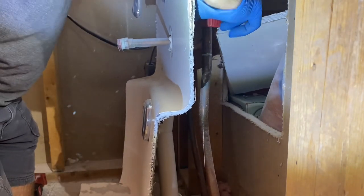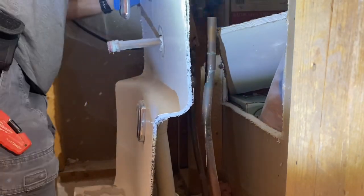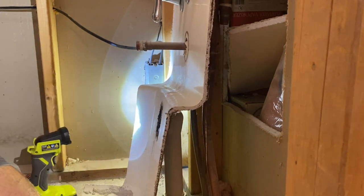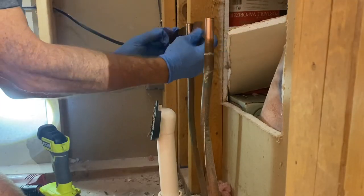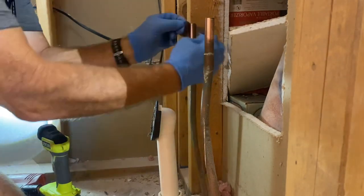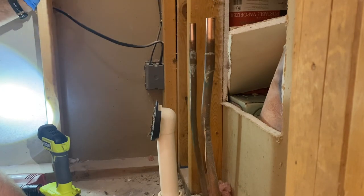The quickest and easiest way to get my client's water back on — we're just going to go ahead and cut these lines and take the valve out with a little piece of fiberglass. Right here I am loosening compression nuts on a waste and overflow and removing that plate. We're going to pull all this out of the way. Let's go back for a second to those compression joints on that waste and overflow — those are not made to be buried under sheetrock.